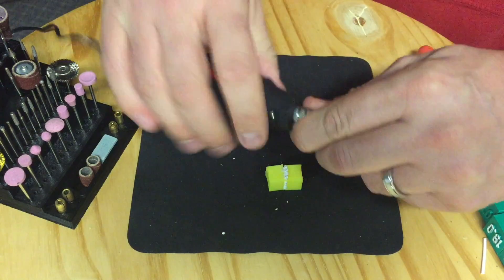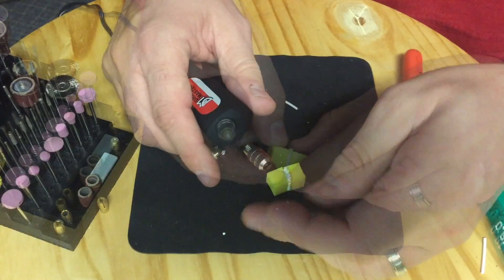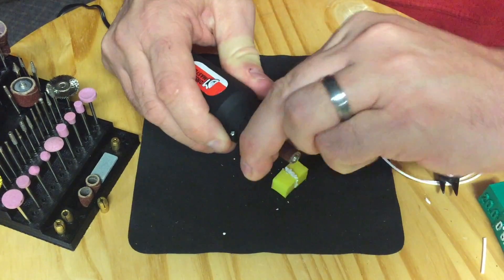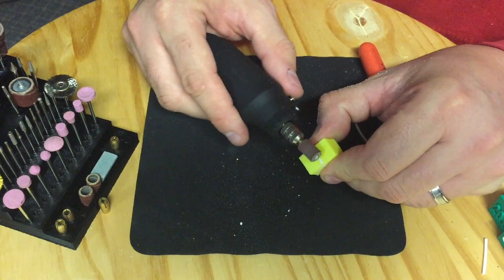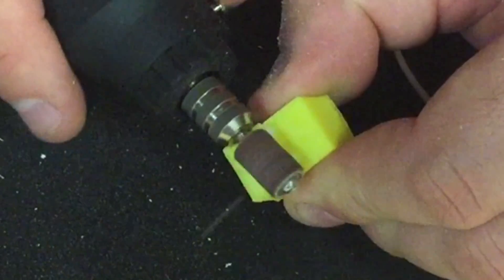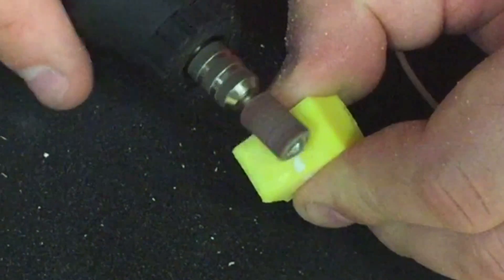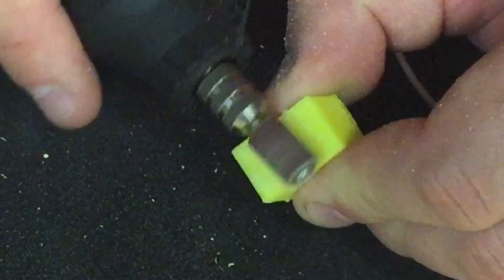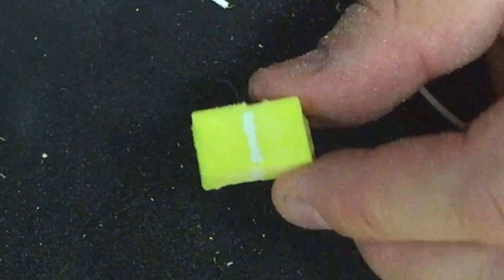Now I've got two sides welded together and it looks pretty good — there's a lot of extra plastic but it feels pretty solid. I'm going to use this sanding tool to grind it down. I want to see how well the white blended in with the yellow to see how well this really works. If I sand this down and there's nothing left then I know the weld didn't really work. But as I sand this I can see that it's sticking — the white and the yellow have bonded together and it's nice and smooth, so I could actually paint the surface if I wanted to.